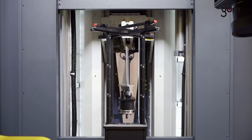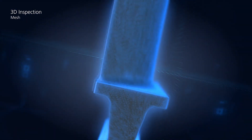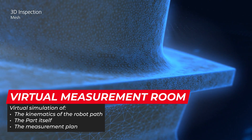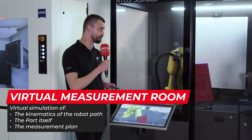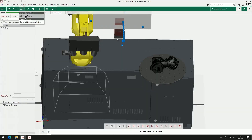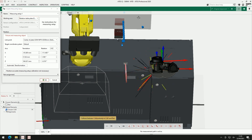Can you tell our audience how easy it is to use and to program? Within our virtual measurement room, which is the driver for the robot you can see behind this, it's a very user-friendly system — there's no pendant to move the robot, it's simply done by dragging arrows around a virtual room. We've also got features like SmartTeach, which, when we put the CAD inside, understands the features and automatically creates a measurement path based on the inspection features within the software. You make it sound easy, Scott!